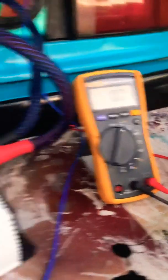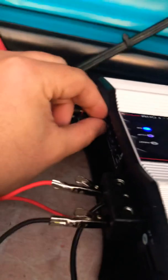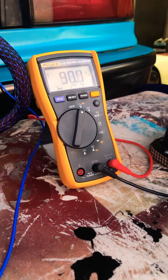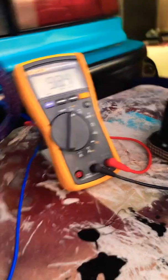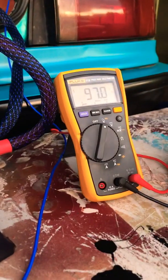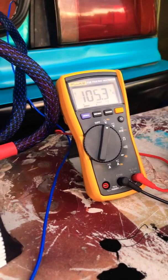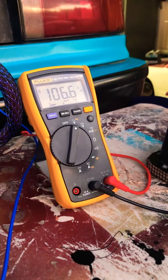Now we've decided that this one is good for 105 volts. I'm gonna reset this one to show you. As you can see, everything's wired up. We're gonna take our knob and continue to turn it. This could be a minute or two to get these set where you want them. It's gonna be very hard to get them exact — try the best you can. If you go too far, the amp will start to show a protecting clip light, so obviously back it off. We're gonna set this one at 105.